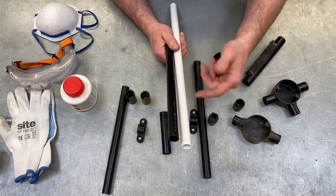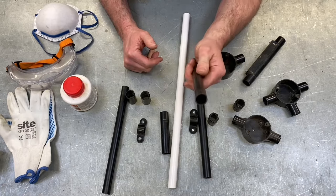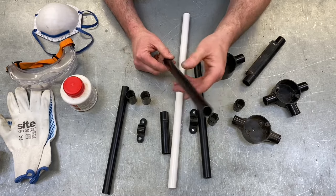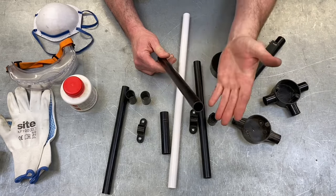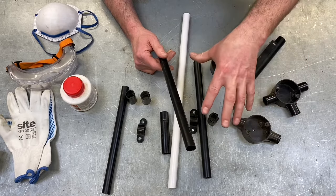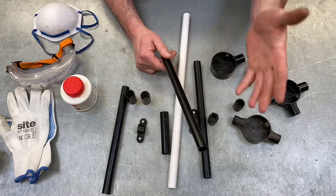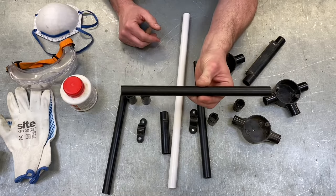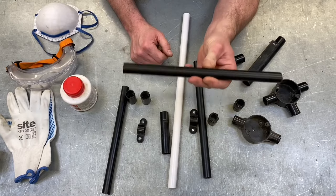We're talking about light gauge and heavy gauge. The plastic conduit used in my workshop is heavy gauge, high impact — meaning it can withstand a blow from a hammer. Light gauge conduit has much thinner walls and must potentially be reinforced by something else. For example, if you're installing a conduit system in a screed or concrete floor, you could use light gauge PVC conduit because the concrete floor protects it. But all the conduits we use are heavy gauge, high impact. They come in a standard length of three metres long.